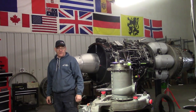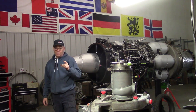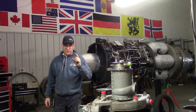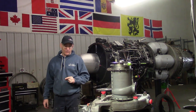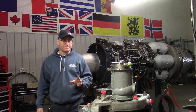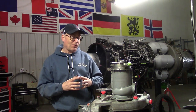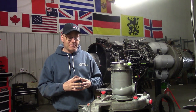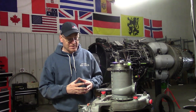If I undo all of these, can I lift the whole thing — the entire compressor — off? The book doesn't tell me whether it's just a spline or if there's an inner bearing race on the shaft that's going to be caught in what they call the two-and-a-half bearing. If it does come off as one unit that would be fantastic; if not, we'll work around it. But until I find out for sure, I'm following the practical procedure of: if you don't know for sure, don't do anything until you find out, because you don't want to cause a whole lot more work and expense.